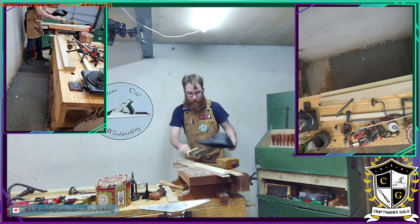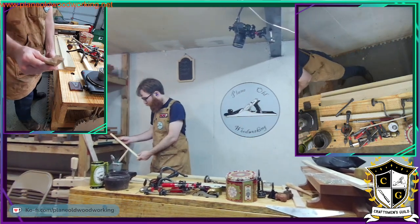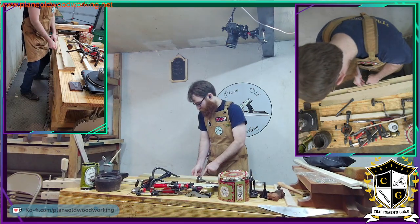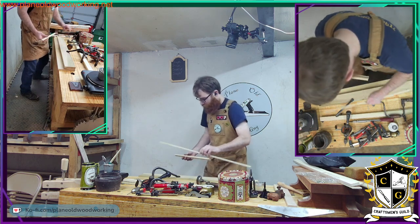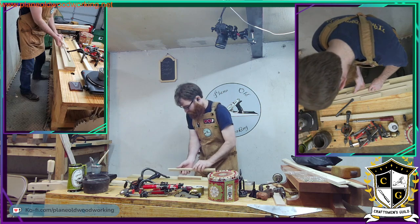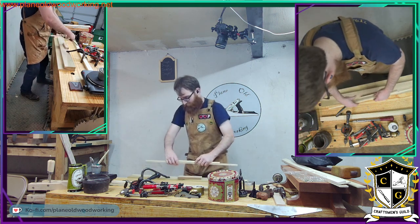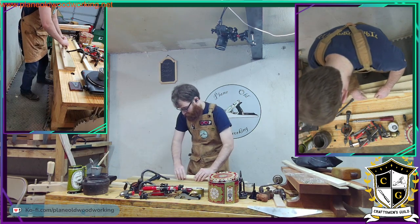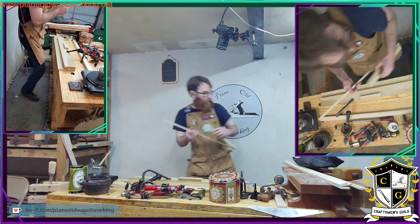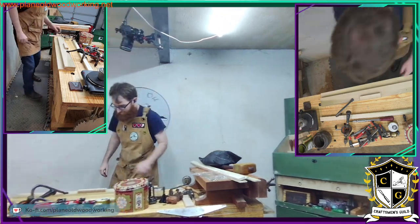for your molding. Now with this one, we're building basically a custom sticking board. It's specifically for this molding. So what we're going to have is one where we can just cut this back rabbet here. It'll just be a regular one. You go up to a space, it'll have another back here, but it'll have a ledge like that so that it'll fill in that back rabbet so you have pressure and you don't accidentally break your molding. And then it'll have another space up here where I can flip it around and it'll be supported against a wall here, but it'll also have the back rabbet support here so I can lock it down and do detail on the back. So that's what I'm aiming to do.